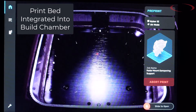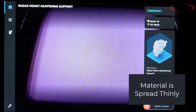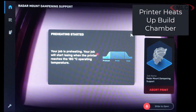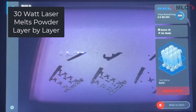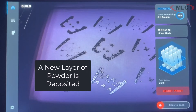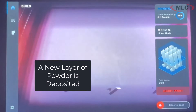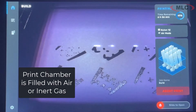A lot of times with SLS machines, people talk about how long it takes to get in there and do the job or pull the material. This one can do some of that preheating and cooling outside the printer, which is pretty cool. It spreads out the material and does a preheat operation. When it's ready to actually start printing, the camera will watch and you can see what's happening inside as it goes. It goes layer by layer, melting the new powder onto the existing parts. You can see there's some really fine intricate details on here. Because it's completely bound inside powder, it doesn't require support and it can do really intricate shapes — really impossible shapes like these lattice structures.